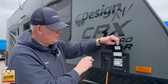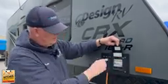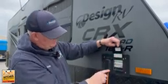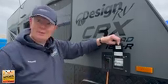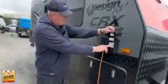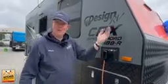If you want to do the opposite, you press the inverter off, bring them up, and it says position 1 normal supply. So you'll see it's up on normal supply and that's got position 1. So that's the correct position for your mains. So what we've done is, with the normal supply off, we've got the alternate supply on. Now we can head inside and turn on your inverter.